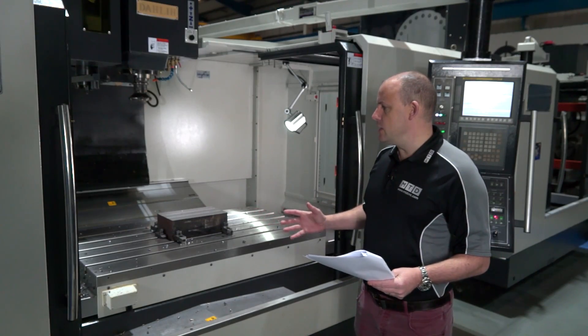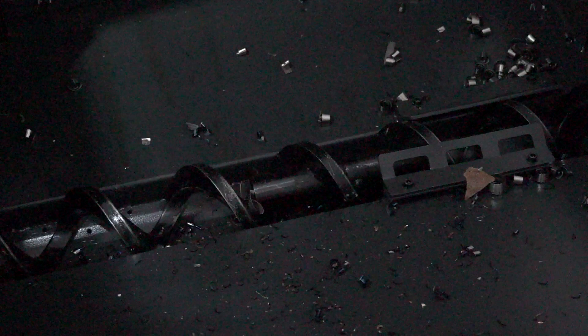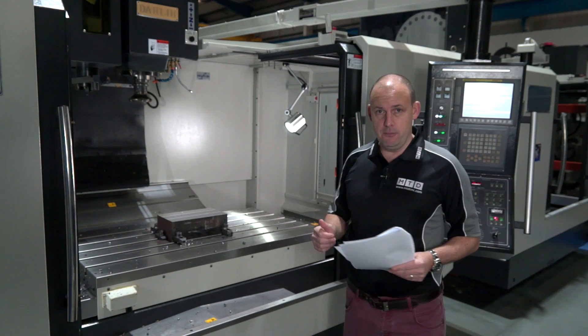As you will notice, the machine has great access with two doors. We've also got swarf extraction on the left hand side and the right hand side of the table, so we've got two augers on this machine that are removing the swarf. We also have coolant flood wash around the machine and access from either door — from the left and from the right.